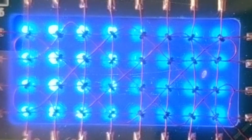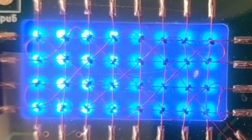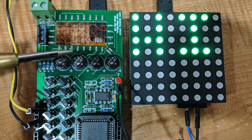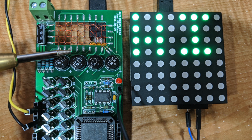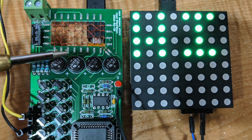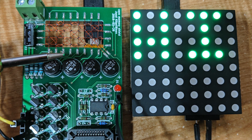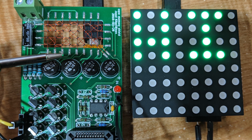Since each core represents a single bit, I thought it would be interesting to visualize the state of each core with an LED, and that led to my first proof of concept. I put together this proof of concept using a serial link between UC's 4x8 core array and a Rainbow Duino LED array. It worked and was surprisingly fun to use.